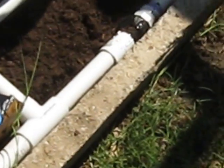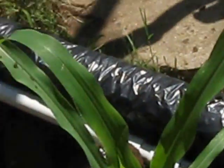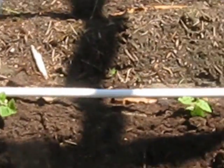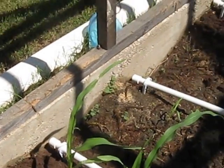Then I have one pipe that comes right here because it controls all the irrigation. It comes here, goes down, and branches off in two parts — one goes to the left and one goes over to the other side. You can see it goes around and all the way over there, and it's capped off. That main line is three-quarter-inch pipe. All the branches coming off are one-half-inch, and they all have corks on every single one of them.